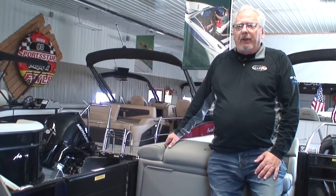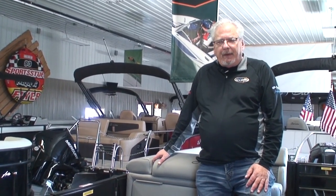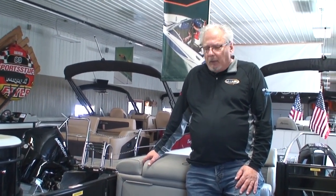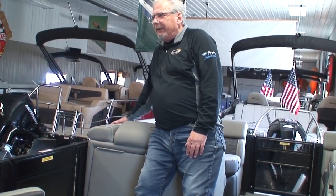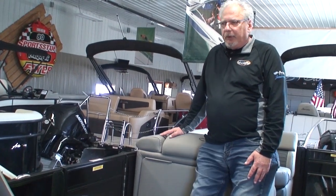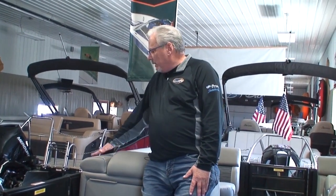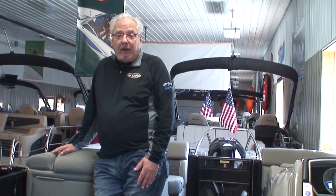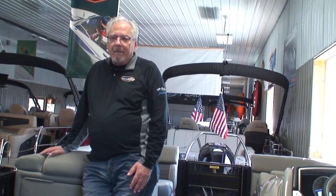We really struggle with that. When we get a trade-in, we generally have to send that boat out to the upholstery shop and have it reupholstered, because people don't want to buy a used pontoon with the seats all torn up or sun bleached. You've seen, especially up here, pontoons where the upholstery looks like a light tan. You might have a cream colored upholstery, but it's like a light tan. That's sunburn. That's the UV light hitting the top of this and literally baking it and drying it out, and that can't be repaired. It has to be reupholstered. That gets expensive. So for that reason, Barletta uses a large amount of UV inhibitor in the upholstery.